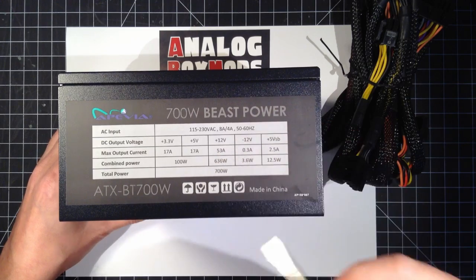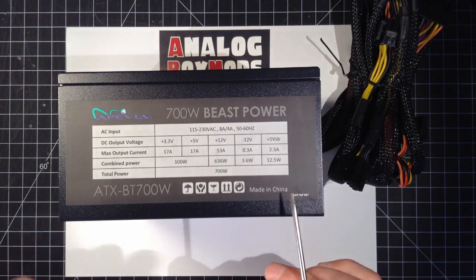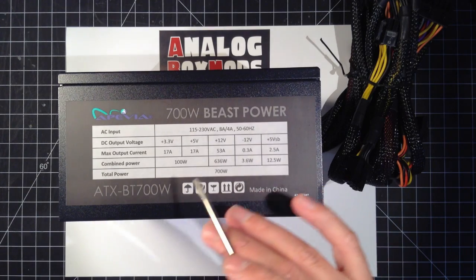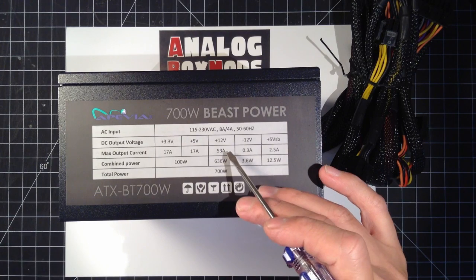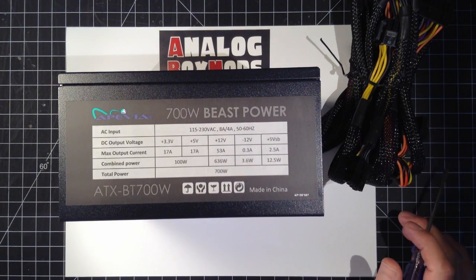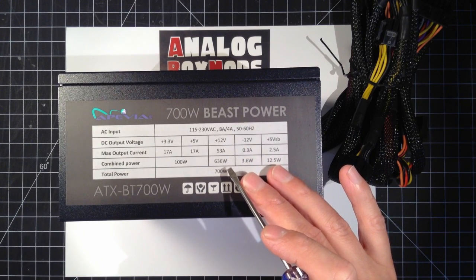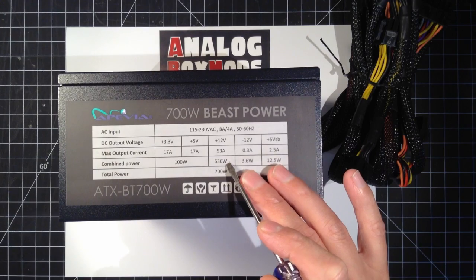And at 12 volts, we can power four vaping devices that'll connect to this. We can use the OKRT 10s. Those are 50 watt devices. With the four inputs we're going to have, 4 times 50, 200, we'll be well under the amount of power this can output. We can use the Raptor devices. Those are 120 watts each. Again, times four, 480 watts, well under the amount of power we have available.